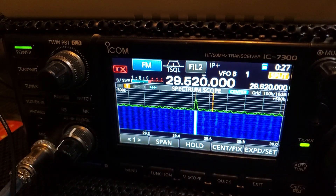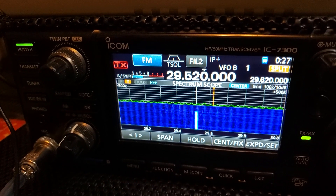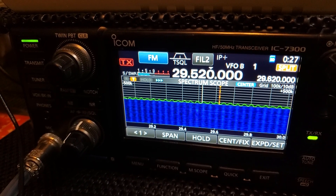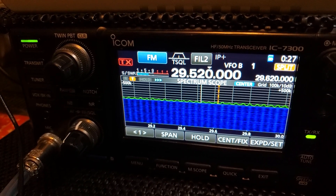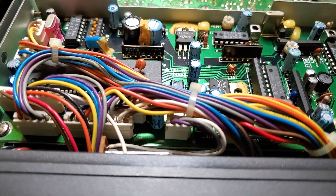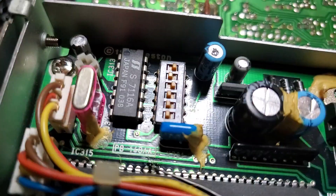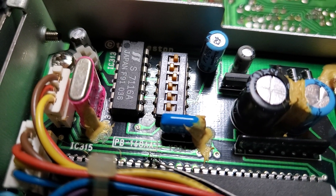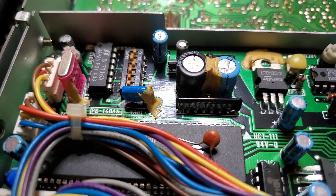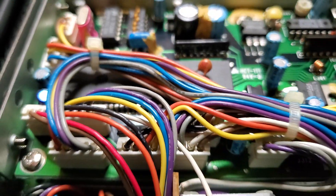We are coming through like we should. That's how you do a 10-meter repeater with tone squelch. Now that's only for transmit — this radio, the 2600, does not have the ability to do receive tone squelch, so you only get a transmit tone. Some repeaters need a tone — that's why it has that optional board. You don't need it for receive; you'll be able to hear everything. If that frequency has other repeaters in other parts of the country and the band is open, you're going to hear them.